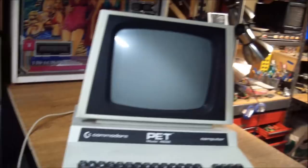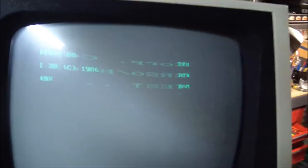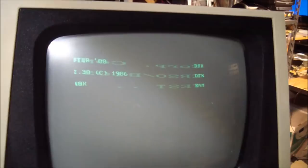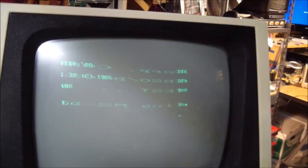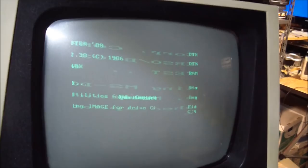And look at that. It is showing something on the screen. It's really ugly, but yeah, the monitor is lighting up. It is accepting signals. I think the horizontal and vertical drive signals are probably a little bit out of range for the monitor. That's why things are folding over, but it's displaying something. The monitor is alive, and I mean, it's not total garbage. It's mostly fold over and the screen height is off.